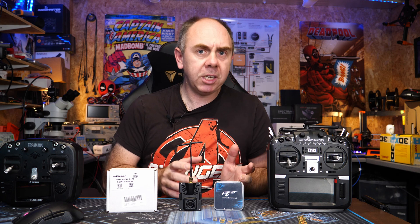All of this range and performance is dependent on the power output of both your transmitter and the receiver. Because this is a two-way system, not only is the power output of your transmitter important, but your receiver needs to be able to transmit telemetry data back — and that's why there is the limited telemetry option for best possible performance. Transmitters are available from 250 mW all the way up to 1 W, and receivers typically have about 17 mW output as standard. However, you can get versions with a built-in power amplifier that offer a lot more performance.